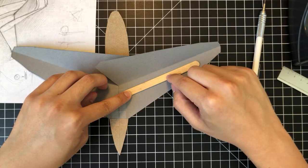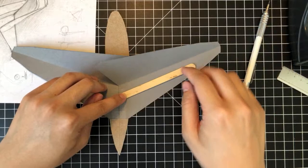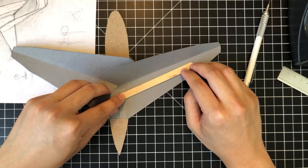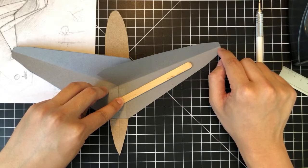And even then, it's not gonna match 100% to the trailing edge, which is a bummer. But that's just because it comes out at you a certain thickness, so you're gonna have a curvature, which is gonna take away from the pure 2D match, right? So it's not gonna fit perfectly, but it'll do. You just don't want to really exaggerate that effect by putting the spar right at the leading edge. So I'm thinking maybe like halfway to the tip.